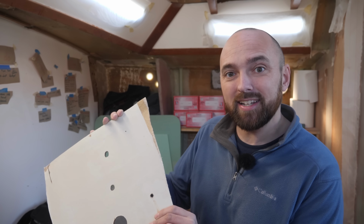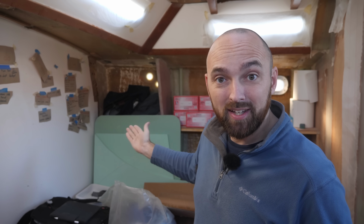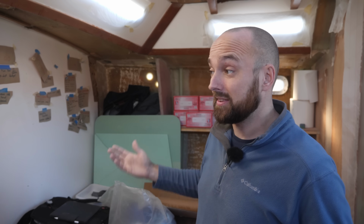Polyester and chop strand is nowhere near as strong as BX and epoxy. So by laying up the same thickness, I know that the new knee is way stronger than the old one. I mean, I haven't saved any weight, but I'm not concerned about weight here aboard Athena.